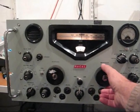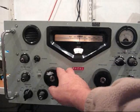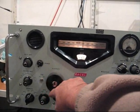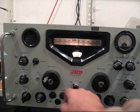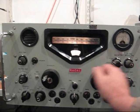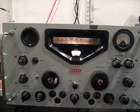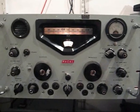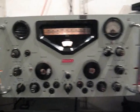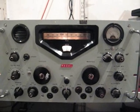It's going up to 14 MHz — there you see it again. Increasing the sensitivity, it's right across the band. At 15 MHz, total noise — no chance of working any sort of DX at all. So what we're going to do is put the spectrum analyser on and have a look at what sort of signal strength we're seeing, and then go out and hunt down the source of this horrible noise.